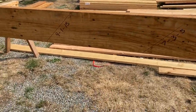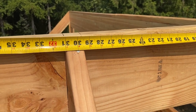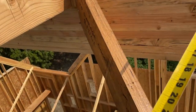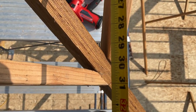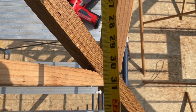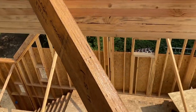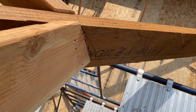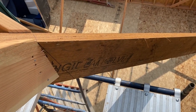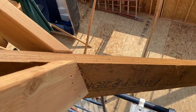I think I'm ready to lean this up and test-fit it. It's 31 there — bumping the ridge and eyeballing straight down that face of the board. These little jacks are on the layouts, but I see I put a 12-common angle on there instead of the hip angle, so I'm going to grab my hip angle square and fix that — you just can't leave it wrong. Anyway, it's been a while, but these fit nice.